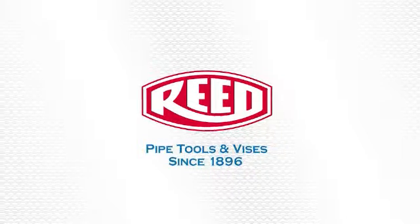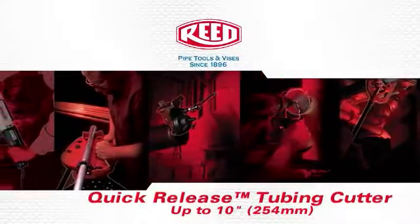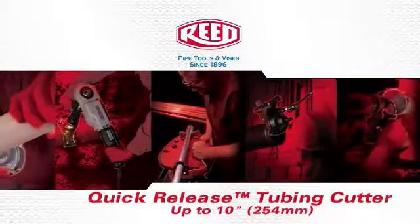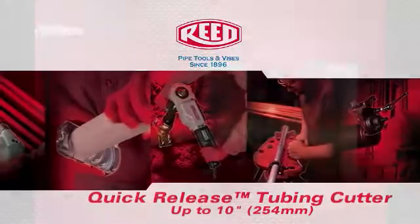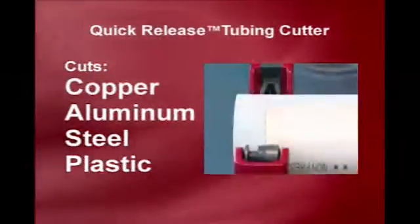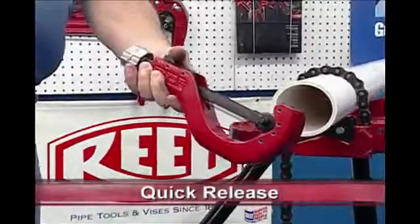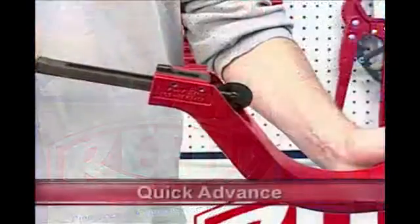The following is a demonstration of Reed Manufacturing's Quick Release Tubing Cutter. Quick Release Tubing Cutters cover capacities up to 10 inches in diameter. With a simple cutter wheel change, any model can cut a variety of pipe from copper, aluminum, and steel to numerous plastic pipe materials. Features include quick release, quick advance, and manual advance.